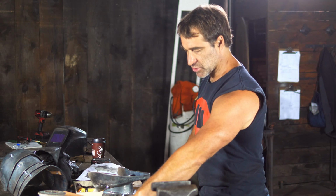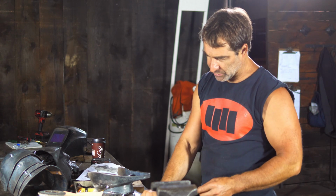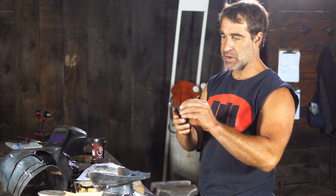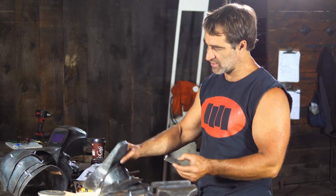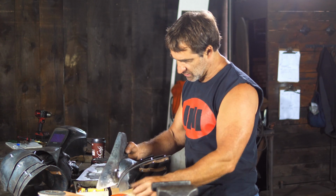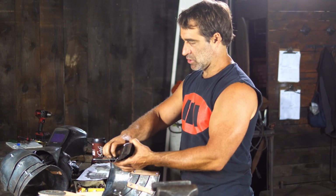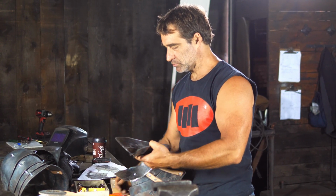And what I did was actually use a rivet. I just used a tiny rivet and then welded a shaft onto it to make it longer, to make a stem there. But anyway, I want to now drill the hole for this and get this attached, mounted in. So I'm just trying to figure out where I want my holes, and just doing it like that. I see my hole to be there. So I'm going to pop a hole in there and drill it out to 3/8.